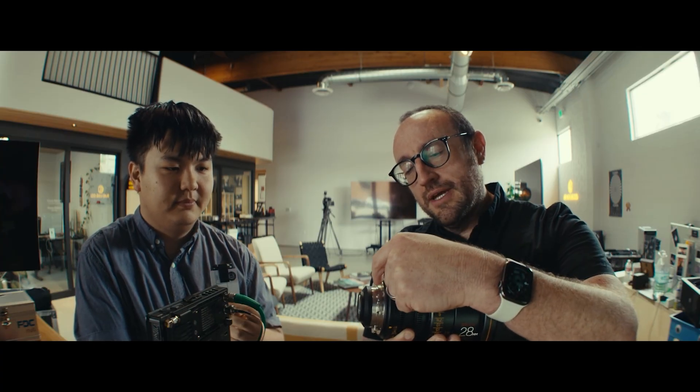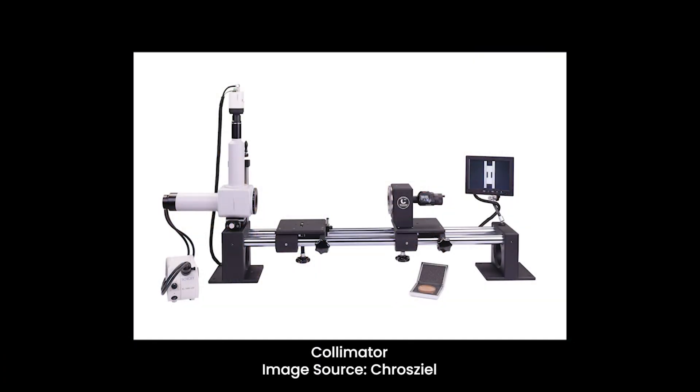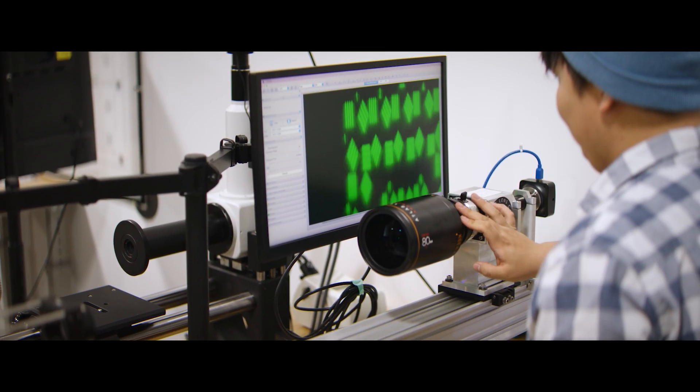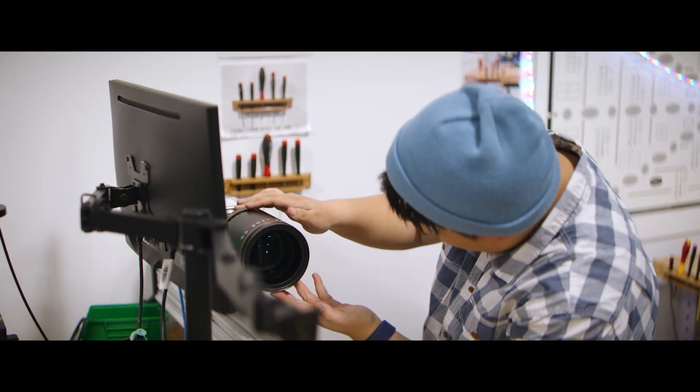A well-toleranced design will make sure lenses are generally coming off very much the same, as ours are here at Atlas. But when you make the mount, you make sure that it's exactly in the right place for the image plane to get the best picture. One way to do that: if you have a reference null lens, you can send collimated light into it and use an adjuster to check back focus by moving the lens slightly and deviating that spacing — but that's kind of complicated.